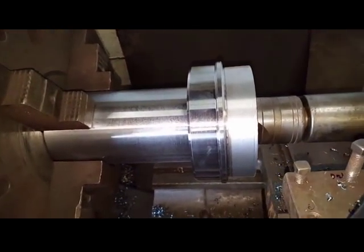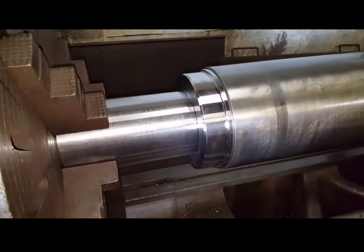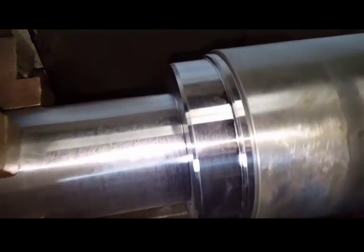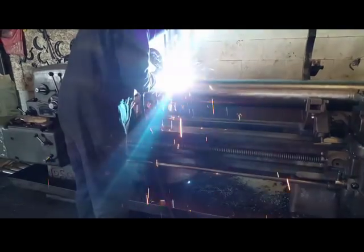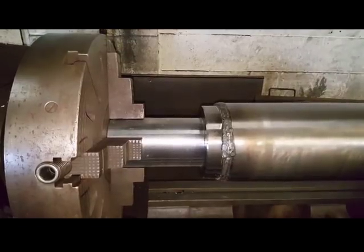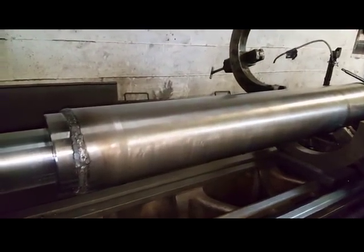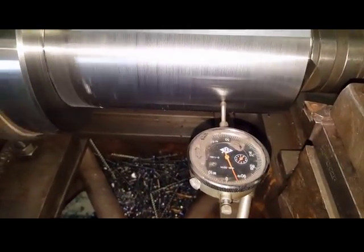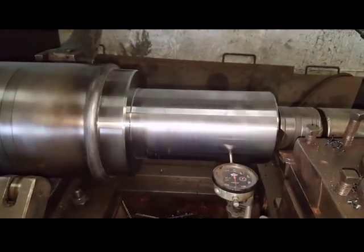So that's all size and size now, like I said, to fit into the tube. All that pressed in, absolutely beautiful, lovely, nice and tight fit. So weld it around here now. Right, it's time to clean up the weld. After all that heavy welding, I'm extremely happy with that. 0.006 of an inch, it's distorted. That's why I left some material to be turned up after.